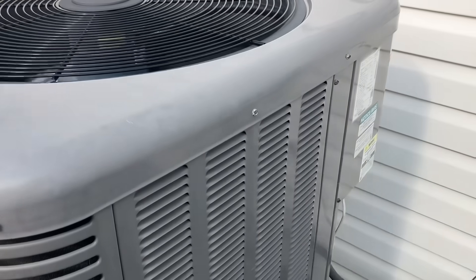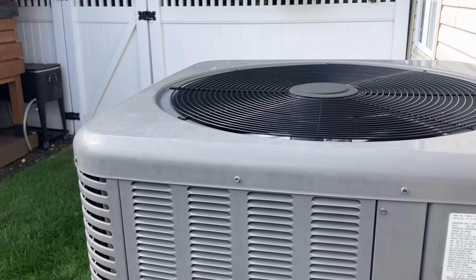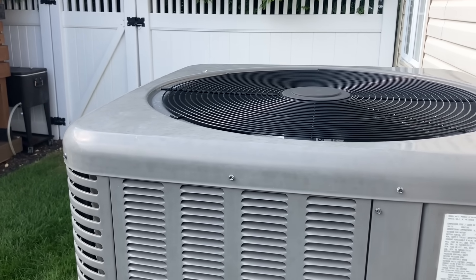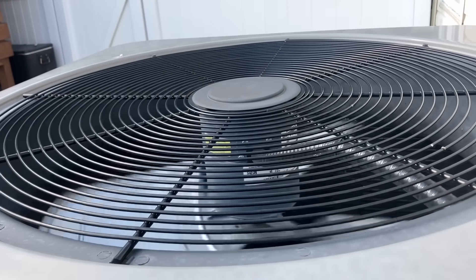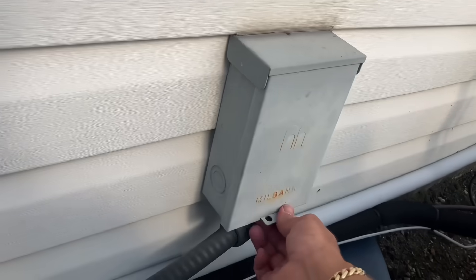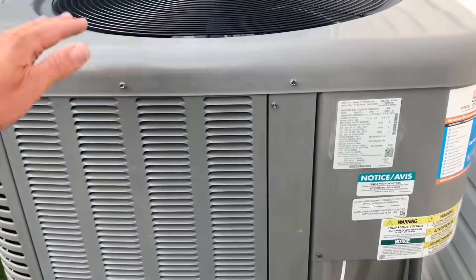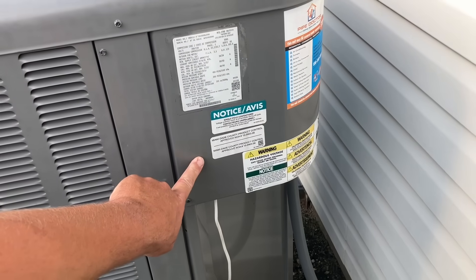The homeowner has his fingers crossed. I want to see if we can hear that hum again. You're not going to hear it now, but the hum we're hearing is the hum of the compressor trying to start. I just pulled the disconnect and you can hear no compressor running — we have a compressor that's not starting. If we're lucky, we're going to find a capacitor in there for the compressor.